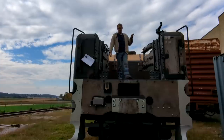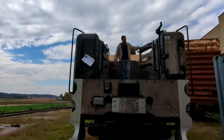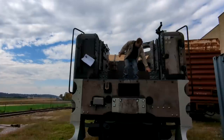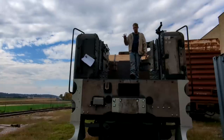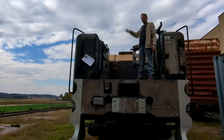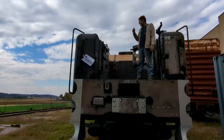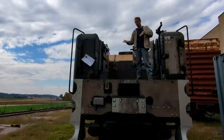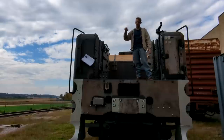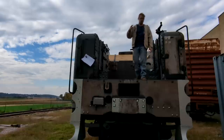This is the front of the B6 tender before it goes inside. We remanufactured these doors and hot riveted them in place, and we manufactured and fabricated the plates that stop the coal from coming through. This tender was unique in that at some point it actually had an oil bunker and burned oil, so when we got it we had to convert it back to look like it burned coal. We had to weld in stake pockets — stick welded with 6010 root and 7018 cover — but I beveled it so you can't see the weld.